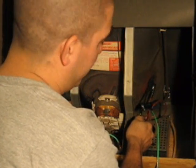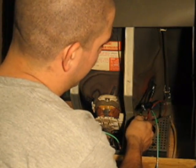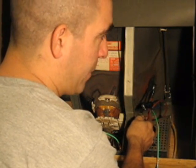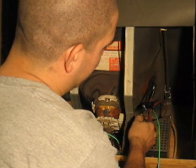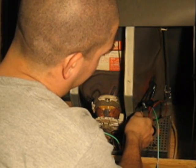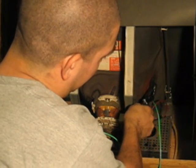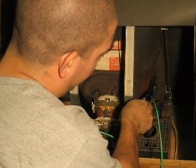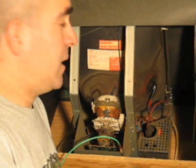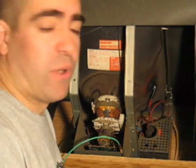All I'm going to do is slide the screwdriver up there, and there's a little metal clip under there. I'm just touching the metal clip with my screwdriver. When I do this, I might get a pop, maybe a little flash, and that's simply it. There it was — there's a little pop. I'm going to go ahead and pull my screwdriver away. I'm going to wait about five minutes or so, and then repeat this process.